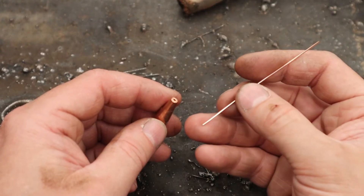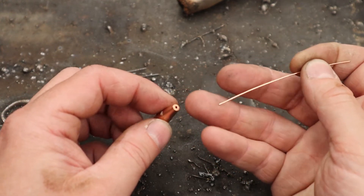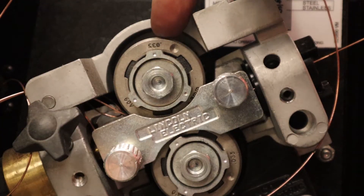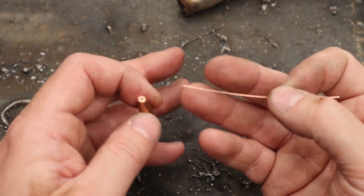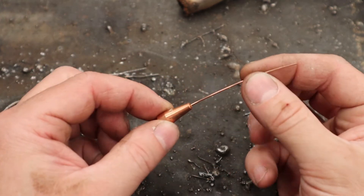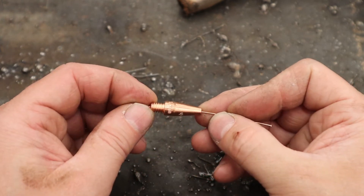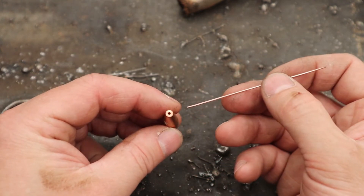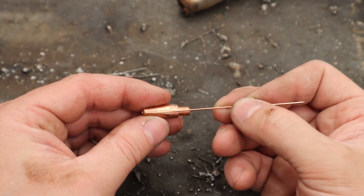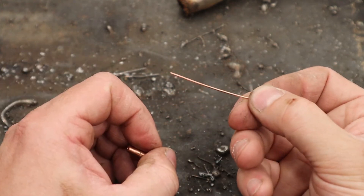The fifth problem is running with the wrong parts for the diameter wire you're using — wrong size contact tips, wrong size drive feed rollers, anything that isn't matched will cause issues. For example, a 40-thousandths contact tip with 35-thousandths wire has too much play. Go the other way — 35-thousandths tip with 40-thousandths wire — and as soon as that wire hits the contact tip it's going to jam and cause a bird's nest. Make sure you've got the right parts.